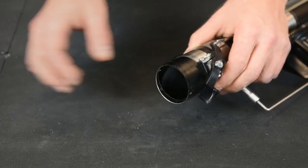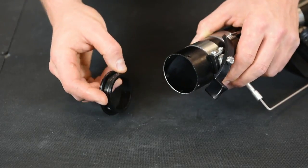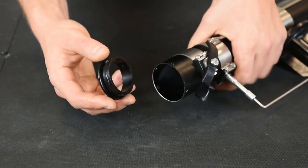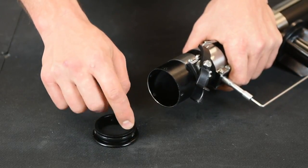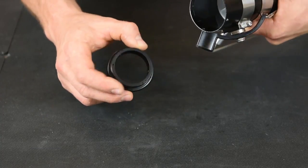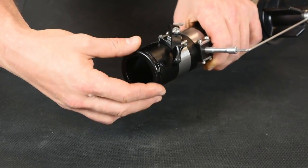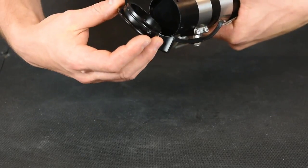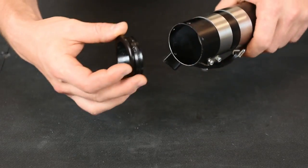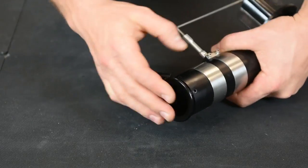Push it in. Once you have the plunger cup inside, you can put your bottom ring back on. The way the bottom ring lines up, on one side there's 2 holes, and on the other side there's a single hole. So you have to line those up with the holes on the base of your taper. Make sure they're lined up before you put it back in.